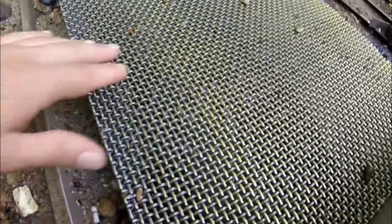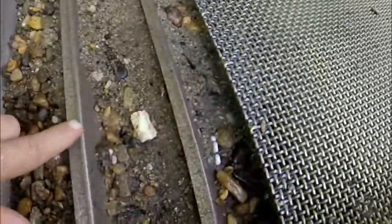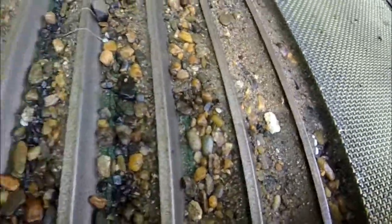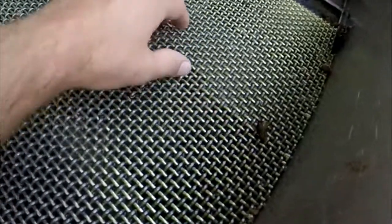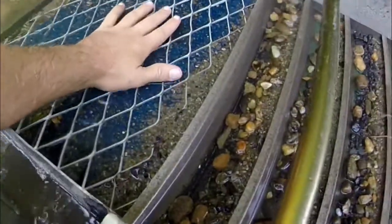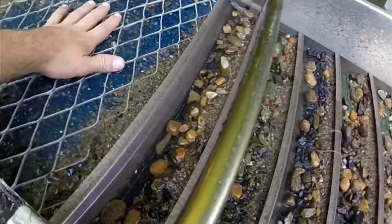Something I wanted to show you — if you haven't seen one yet and you don't have one yet, you need to get one of these screens for the middle of your box. If you got the three-stage instead of the regular punch plate — you know, it's flat — we think the gold tends to kind of ride out. I'm telling you, we're seeing almost no black sands and lighter sands up in the back-stage area, because this woven metal has a lot more pull. It pulls it down a lot more and it works way better. Everything seems to go down to the bottom. We've been seeing a lot more gold in the bottom. Makes me wonder how much we've been losing. We've stopped seeing gold back here — last three days in a row, we've seen no gold back there at all.